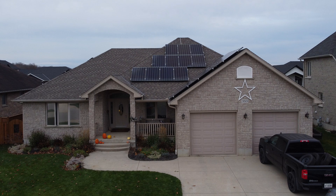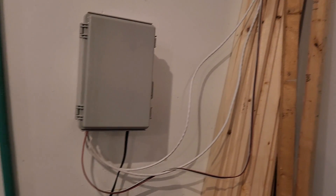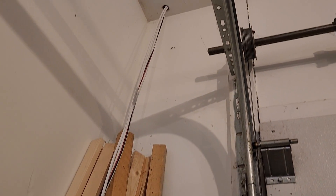For my install, I plan to place the power supply and controller in a box on the wall on the right side of my garage. I will run the power and data cable up through the roof and then along the roofline. I will do power injection in two places. Because I tend to overdo things, I will be running two independent 14-gauge wires from the output of the Dig Uno controller.